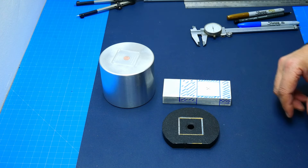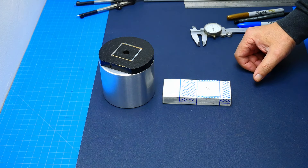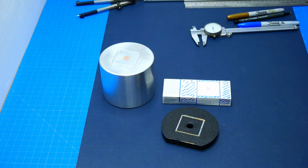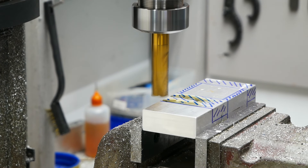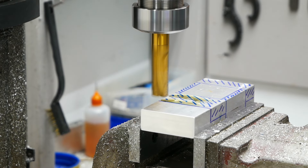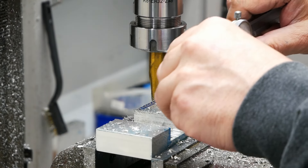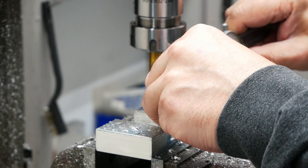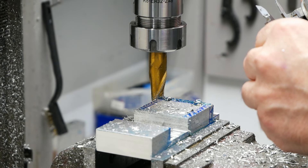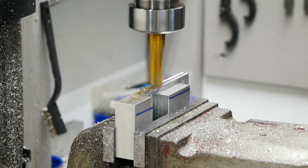This plate goes as an isolator between the heat sink and the cup holder. We're going to machine this part out as well — so we go over to the mill and get this going. I'll get my caliper to make sure the width is exact to the TEC. All looks good so far — I'm going to finish this up.